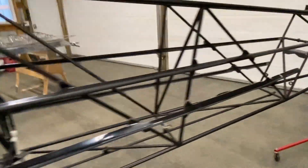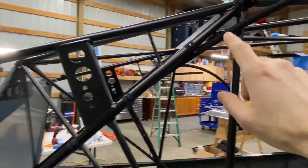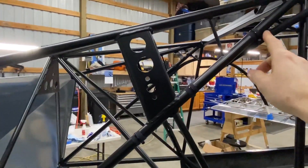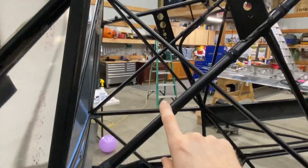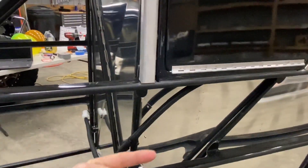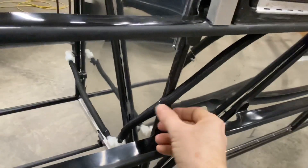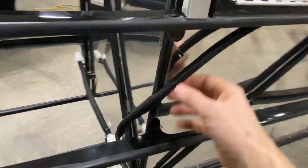That covers both fuel lines on the left tank. The right tank also has its rear fuel line — again extra long, zip tied with friction tape and doubled sleeving. This one runs inside the fuselage parallel to the other. Through a custom notch in the baggage compartment and zip tied there. I was concerned about the pressure a double bend would put on the nylon fitting, so I ran mine inside the stringer and came out through another hole, giving a more gradual, less-stressed bend. Then the double tube, friction tape, anti-chafe, and zip tied. That's how I did my fuel system.